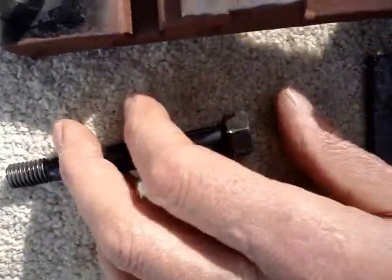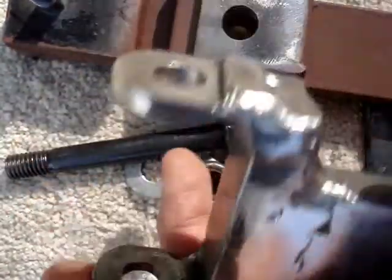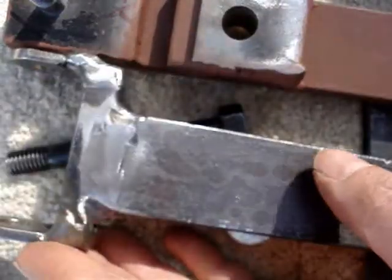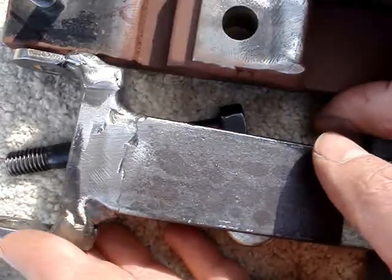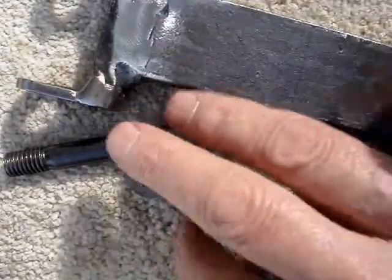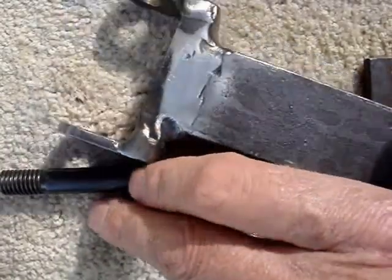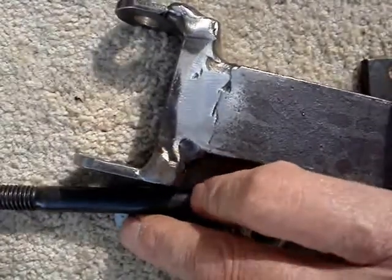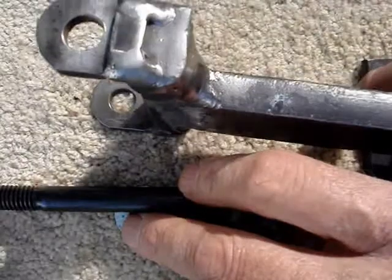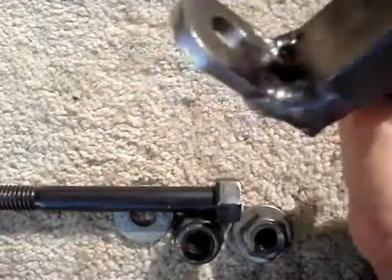It's in the primer stage now. Today I expect to find my huge tube of silicone grease — I don't know where it is but I'm looking high and low. I want to use silicone lube on the FRP — fiberglass reinforced plastic — rear wheels instead of petroleum-based lubes, because I'm afraid petroleum-based lubes may deteriorate the plastic. I've got plenty of petroleum-based lubes but I'd rather not use them on those big rear wheels.